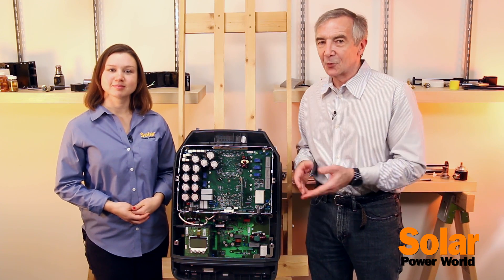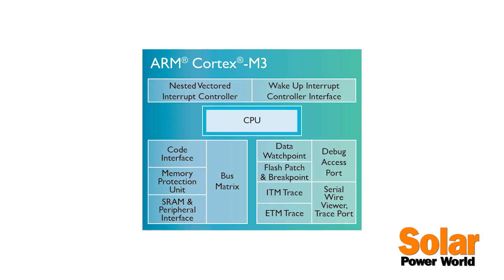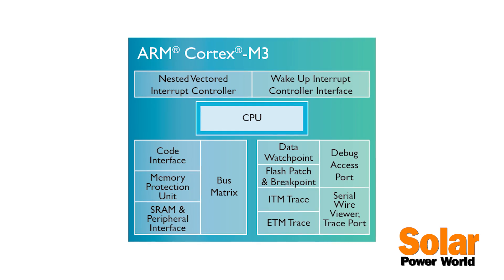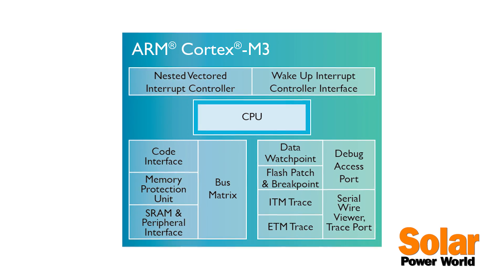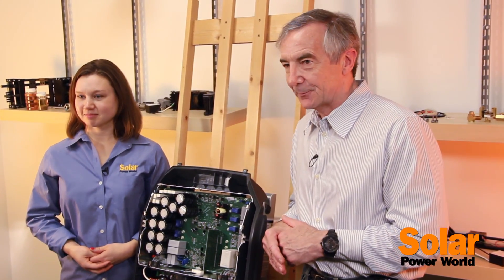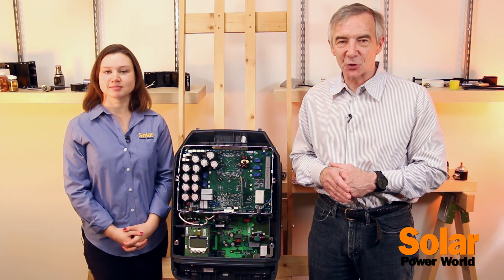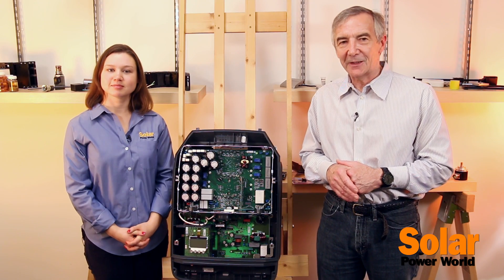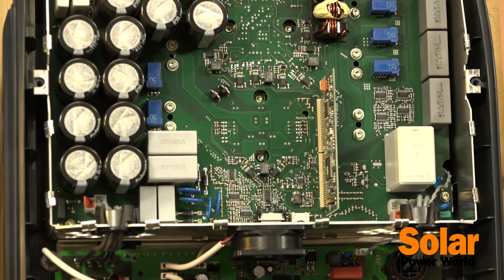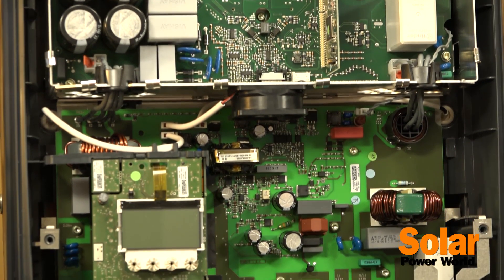On this plug-in board there are only a few main chips. The main one is an STM32F100ZE, which is a high-performance ARM Cortex-M3 32-bit RISC core operating at 24 MHz, which also contains high-speed embedded memories and a 12-bit analog-to-digital converter — something that would come in handy for measuring power levels accurately. Also on this plug-in board is a macro cell array chip, which is basically a prefabricated array of higher-level logic functions, along with some analog comparators and a solid-state switch chip. These would all come in handy for metering, because the key parameters calculated during energy measurements are root mean square current and voltage, active and reactive power and energy, power factor, and maybe frequency.